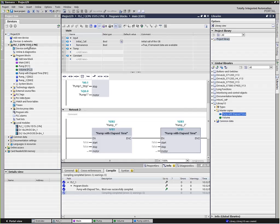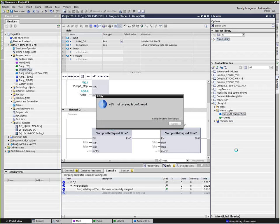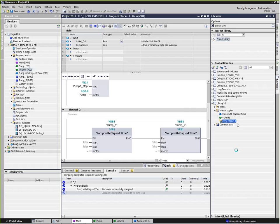So things like, I can save this whole PLC in a library. And what that has done is it's now given me a copy of that PLC with all the code, the configuration, all the hardware, and so forth. So if we want to start with a template that we use over and over again, I've just done that. And all the work that we've done so far today is now saved in that template. And if this was a starting point for a future project, we pull that in, and all that work that we've done before, we reuse again.